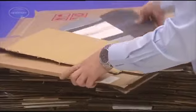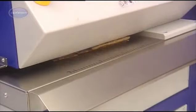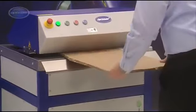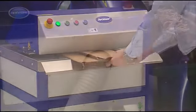The high-volume Ecopax CP428S2 is capable of shredding cardboard up to 17mm thick to a width of 420mm in a single pass and has a production output of up to 9 cubic meters an hour. This 3-phase machine is also capable of unlimited, continuous operation.